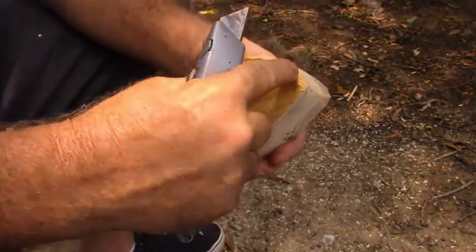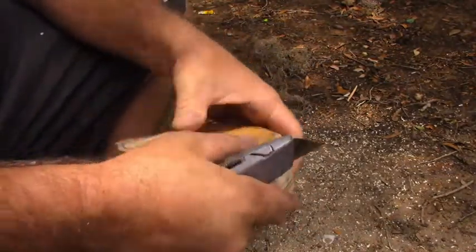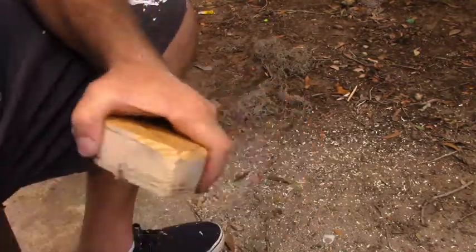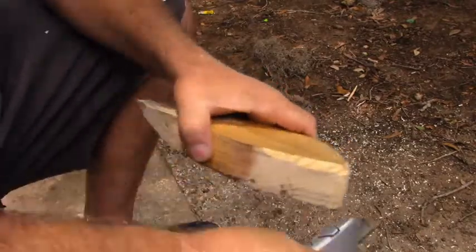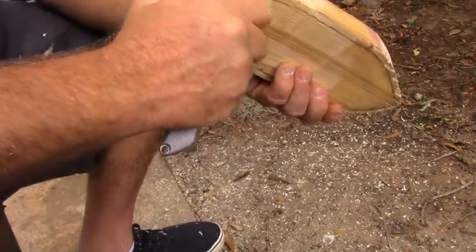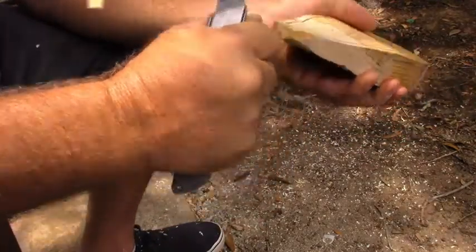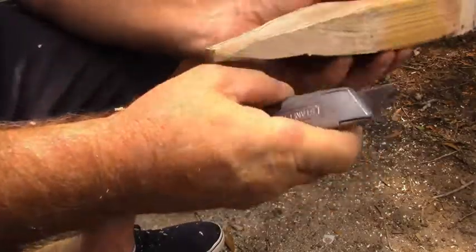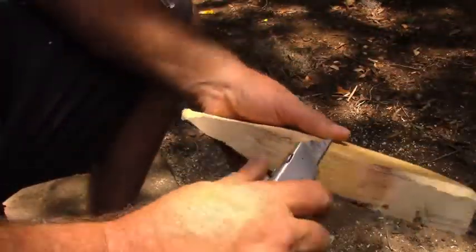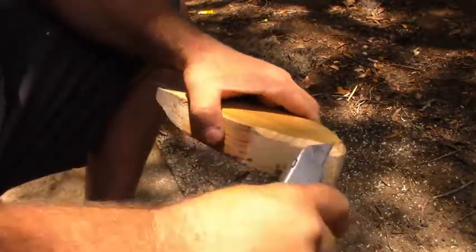It's much harder to cut through the grain this way than it is down the length. I've tried making small lures, and it's really hard to carve, and I ended up using my thumb in this way, kind of like peeling a potato. But you don't want to be cutting on a small piece of wood towards your fingers. With a big piece of wood, I can hold it from the back, and I can carve outward just to make better progress.